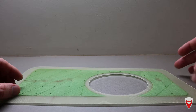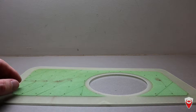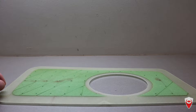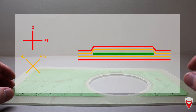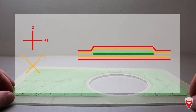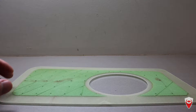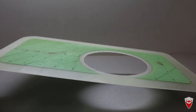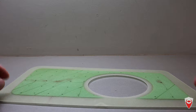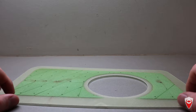The previous one was out here somewhere and didn't actually have an end. Apparently the one this one is replacing got damaged when the car was going in for a repaint. It's a pretty simple part to make — I'm going to use my CNC router to create a three millimeter thick PVC foam core and then do a symmetric two layer per side glass layup using 200 grams per square meter glass with plies biased in 0/90 and 45/45 directions. From there I'll throw the whole thing back on the router, cut it down to final dimensions, and then you have this part.